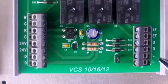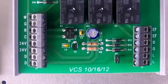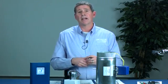Finally, at the bottom of the panel we have a couple of L terminals. These are override terminals for an outside temperature sensor or an outside humidity sensor — that will override the system. The reasoning is simple: say you're in the middle of winter, the house is heated up to 70 degrees exactly where you want it, but outside it's a balmy 5 degrees — that's probably the last air you want to bring in. Conversely in the summertime, the house is cooled to 70 degrees, but outside it's 90 degrees with 70% humidity — that's really not fresh air. So that allows you to set up temperature and humidity overrides for the system.